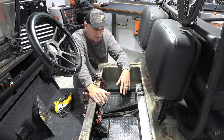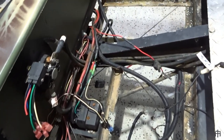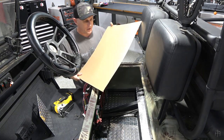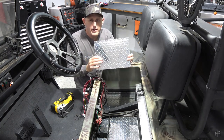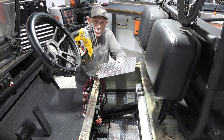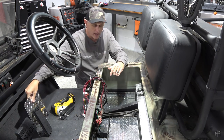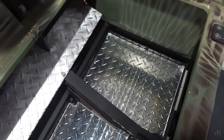My battery tray did not have a bottom - the batteries were just sitting in angle iron trays. I needed to create a bottom. I wouldn't recommend plywood because it gets wet and rots over time. What I did is I took some cardboard and cut out templates that fit exactly in each one of my battery trays, then ordered some lightweight aluminum diamond plate, transferred the template onto it, and cut it with a jigsaw with a metal cutting blade. By doing the cardboard template first, you cut it right the first time. You'll have a solid, washable base that will never corrode or rot.